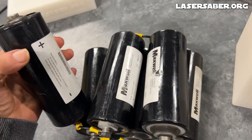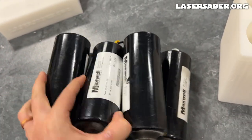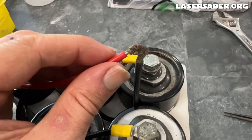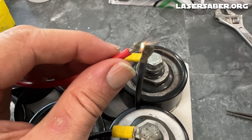I've connected these all together. They're connected in series, so we have our positive to negative, and that connects to the positive on the next one. They're all just wired up in series. After sitting on the shelf uncharged for years, these old supercapacitors still had a ton of energy left in them.